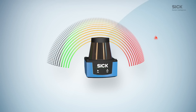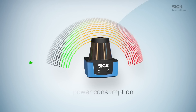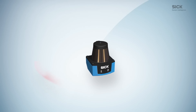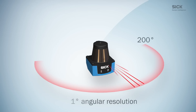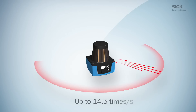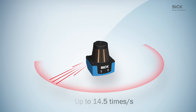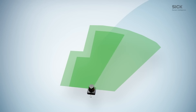Due to their low power consumption, TIM-1 sensors are particularly suited for mobile applications using batteries. With a 1 degree angular resolution and a field of view of 200 degrees, TIM-1 sensors detect even minute details and ensure highly reliable area monitoring. No matter if the monitored area is rectangular or has a free shape, you can easily design the field sets to suit your application needs.